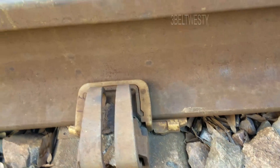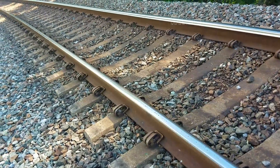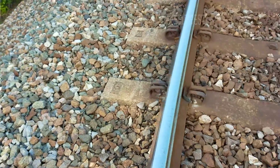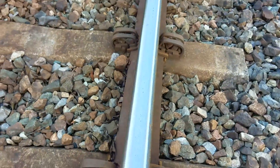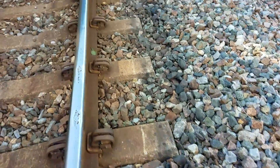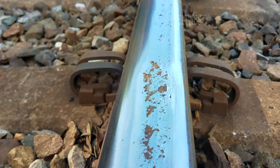Clips — look like this is welded rail. This is the higher side. This is the lower side — it wears a lot more here. This looks really screwed up. What that looks like is a fatigue failure on a race — a ball bearing.